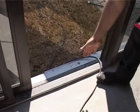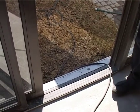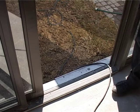Now we're going to go inside and look at the inside situation to see if we can spot any possible problems there. So let's go inside the house and have a look there. Here we are in the room downstairs where there's a wooden floor going to be. This is going to be a laminate floor. Minutes ago, we were on the outside where we saw the door here with no overhang and with a sill that has got a slight drop down. So it's safer than if it was flush, but as I say, you can see the scenario on the inside. The rain drives against this window, possibly may come through. So your plastic here, of course, is extremely important. And of course, just mention it to the owner, it could possibly happen. Then it may absolve you from having a problem later.